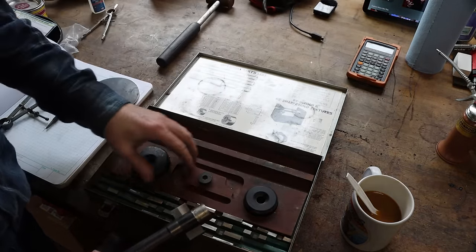So the first thing that I'm going to do is just drill an alignment hole, just like I did in this flange with this drill. That way I can assure that my 2-inch hole that I put in here is centered with the center of this flange. So once I drill that hole, I'll slide that drill bit in. I'll use some really cool expandable, I can't think of the name. Transfer punch. Took me a minute, but I did. So I'll just drill that hole, slide the drill bit down through both, use my transfer punch, boom, boom, boom, and then I can drill my 1-inch hole. Then I can go in with that spade drill and put the 2-inch hole in it. That's the plan.